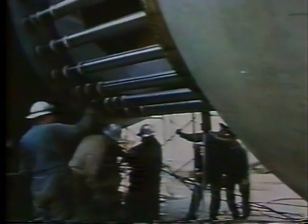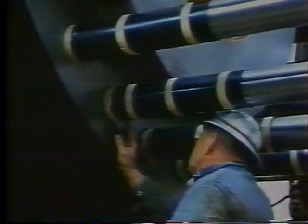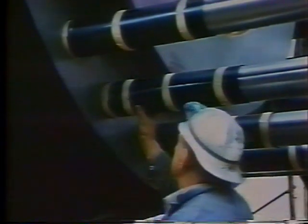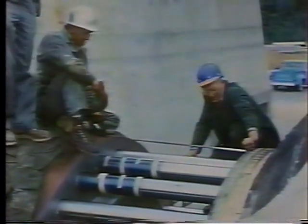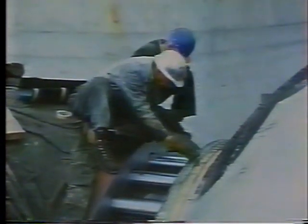It is a tribute to the construction contractor that the sphere was so rigged for the lift to fit it on the shaft that it hung plumb. Hanging so, the sphere with its 28 500-pound studs was drifted without interference onto the shaft. This operation was accomplished without any damage to the stud threads, which were protected by lengths of stovepipe. The sphere now joined, its stud nuts were run up inside the shaft and each was tensioned to 950,000 pounds by means of a power-driven wrench procured just for this job.